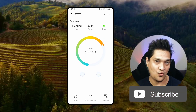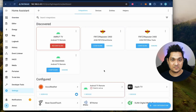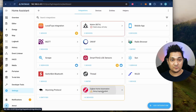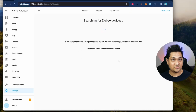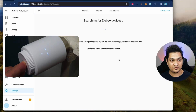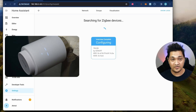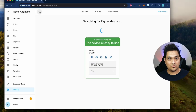Now let's look at how to do this in Home Assistant. We're going to go to Settings and integrate the device using Zigbee Home Automation. In Zigbee Home Automation, under Devices, click 'Add Device'. This will start searching for the TRV. Put the TRV into pairing mode by turning the wheel to off and pressing and holding until it starts blinking. The device is now being configured and detected by Zigbee Home Automation. The device is ready — I'll keep the default name and visit the device.